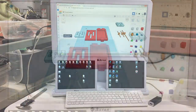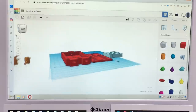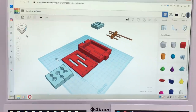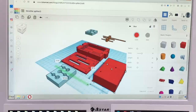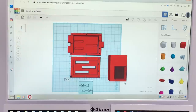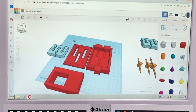I ain't never learned to do CAD, but that's not really a problem. There's a totally free resource on the internet called Tinkercad, and that's where I do all my design stuff. This isn't a traditional CAD package — it's a much simplified type of CAD, and it's actually easy to learn. The throttle splitter thingy was developed using Tinkercad. I'll give you a 10-second demo. Tinkercad works by adding and subtracting basic shapes. You select a non-solid object, stretch and pull it into shape, or just type in the dimensions. Select the whole part and click on the group icon — and voilà, now you have a useless block with a hole in it. This is a free resource, and there are plenty of tutorials on YouTube to get started.